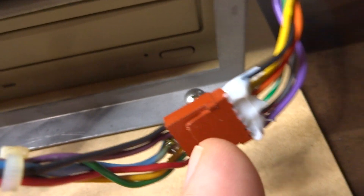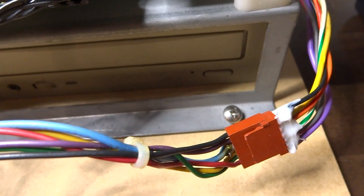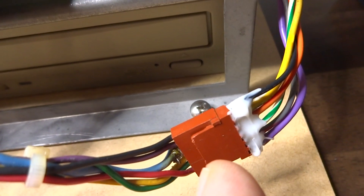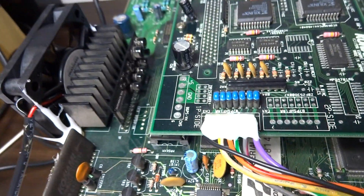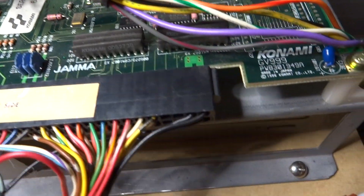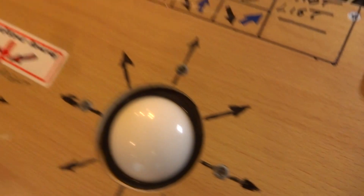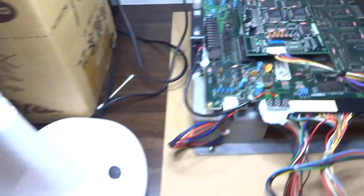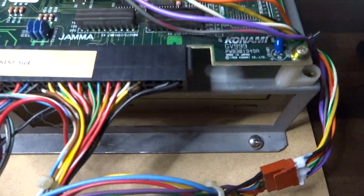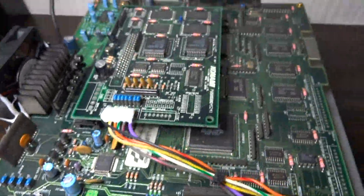What I've done is I have a couple of Golden Tee Golf boards and there's only one of these connectors used on it, especially for player one up to four players. So I took one of the other connectors, desoldered it — there are three of them on the board — recycled it, wired it to this, and added a little bit of hot glue to keep it in place. That way I can just easily connect my old Golden Tee Golf setup and plug it in here without any problems.